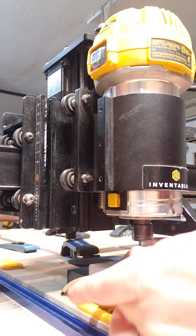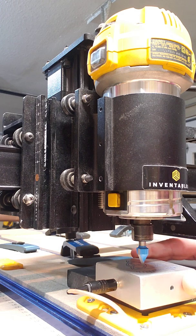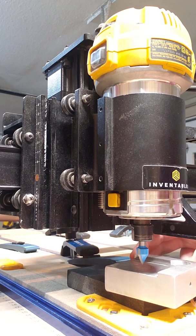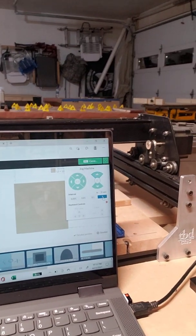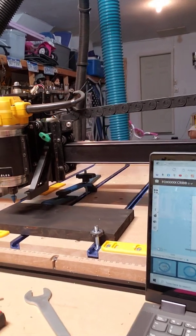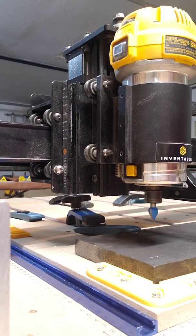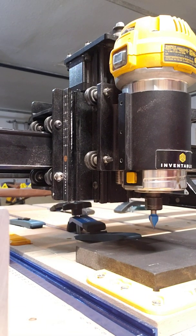If I were to XYZ all at once with a straight bit, I would have the probe in the corner like that. But you can see the probe isn't very stable here on the edge. So what I like to do is come over to the computer, set that for one inch, and then jog the machine counting twice on the X and twice on the Y, and just kind of make note of that movement. So now I don't really care where I Z on this, but if you had a specific spot that you want to Z, you can certainly jog it over to that location.